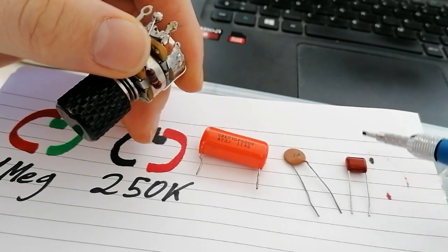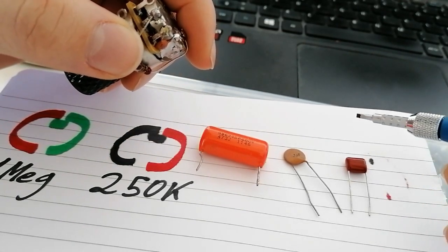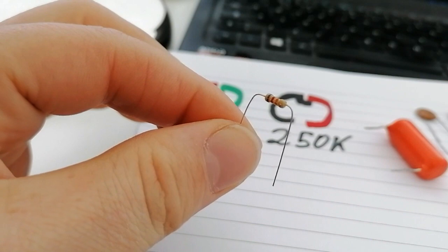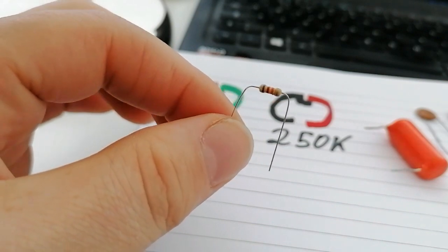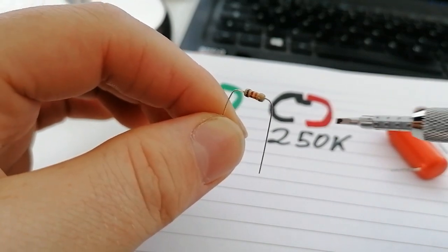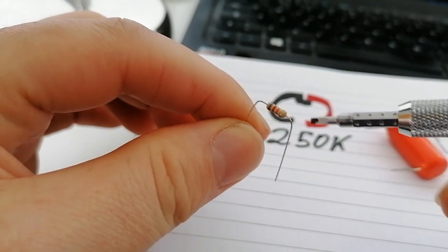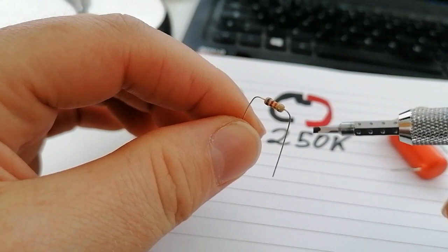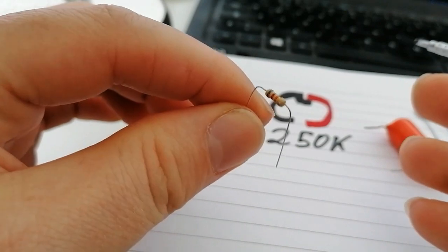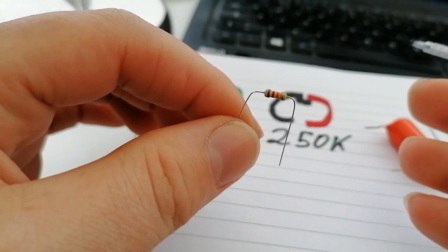The TBX comes with a stock capacitor of 22 nanofarads, which I believe is more suited for guitar, as it tends to make the bass sound muddy in my opinion. The TBX tone kit also comes with a stock 82k resistor, which I believe really drains your signal. As a matter of fact, most people are surprised when they try one of these and wonder how it can be a passive tone. That's because the stock resistor is draining a lot of your signal. Remember, you also lose volume with the resistor, whereas with a capacitor you only lose certain frequencies. That's why another mod you can do is to put a 1 or 2 nanofarad capacitor instead of the resistor. Personally, I prefer the resistor.